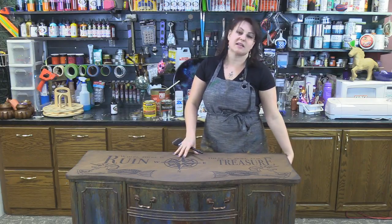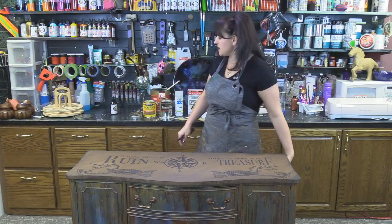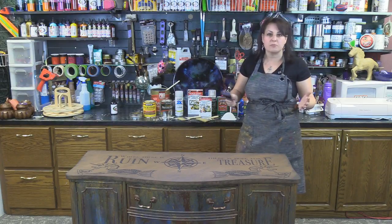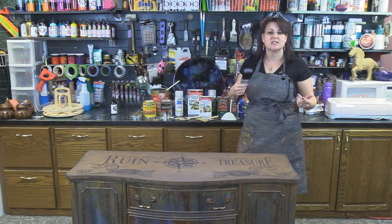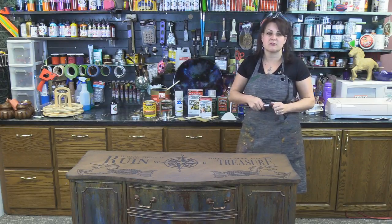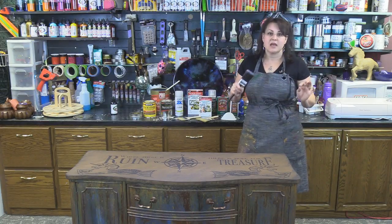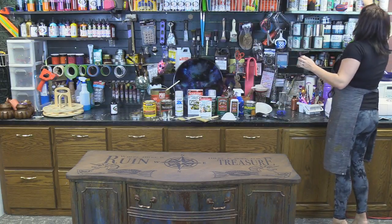Although on the base, that's what I used to lock the unicorn spit to the cleaned existing finish of the base. Another thing is you don't want to use good brushes when doing your clear coat, because with unicorn spit, you cannot use a water-based product. If you are going to use a good brush, make sure you have some mineral spirits or some thinner to keep your brushes nice. It would be the same stuff you would use to clean brushes for oil painting. For me, I just use cheap little throwaways to keep things simple, because it is important to use a non-water-based clear coat. Now, if you look on the can, like this one here, let me see if I can grab one for you real fast.